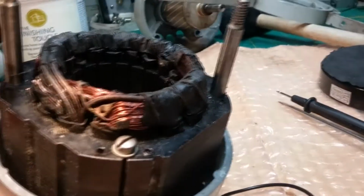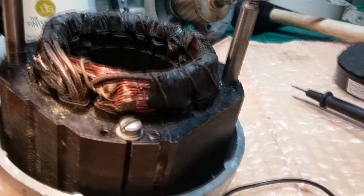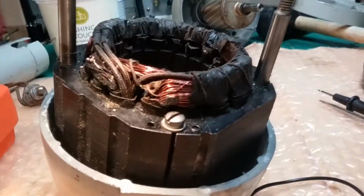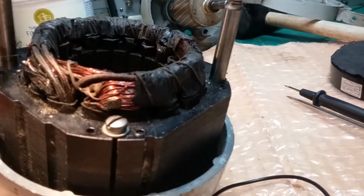This is common on these MobileAire fans. They get a lot of use. They usually run in a factory where it's hot, and they're on all the time, and they're on high current and high voltage, and then these capacitors start leaking.